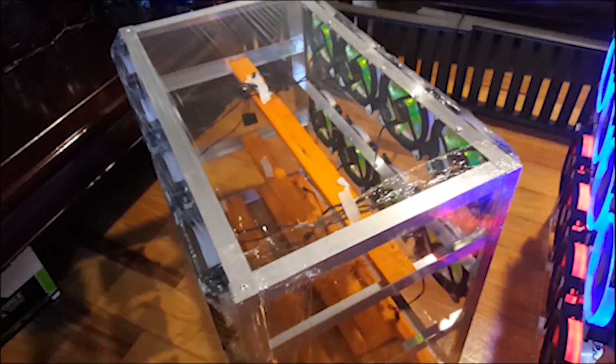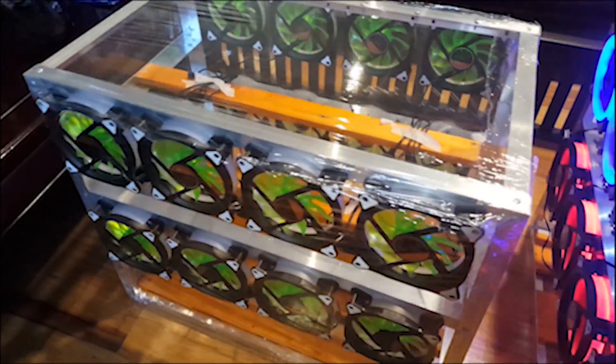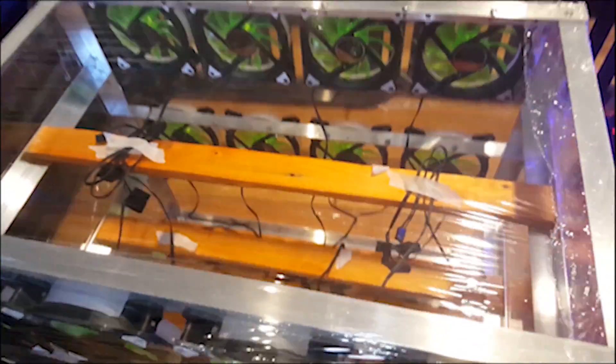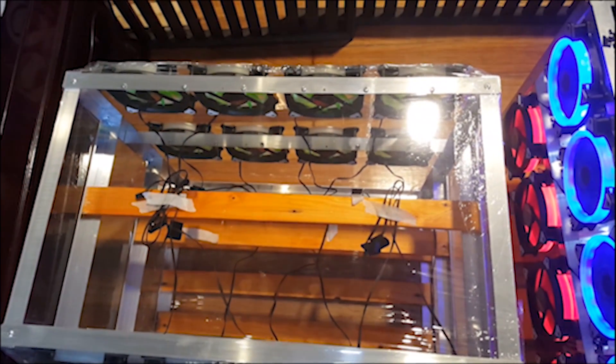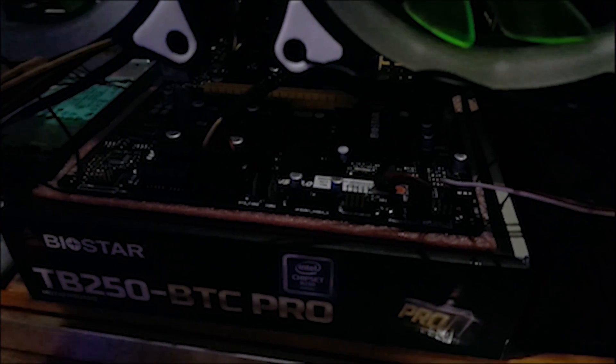I ordered the same mining rack from Mining Rack by Abbey where two sides of the rack have fans. Now to those saying this rack is pretty pointless, try setting up your rig in a cramped area on the second floor of your house here in the Philippines — then you'll realize that managing the airflow can make a huge difference. Now these are items that are not really critical but you might like to add in your build: a surge protected extension cord. There's one miner here in the Philippines where he experienced a blackout and when power went back up, his power supply immediately turned on and fried one of his video cards. These aren't really expensive so better use one just for extra protection. To avoid using a screwdriver to power up the motherboard, I used a spare 2-pin wire from an old desktop — since it's actually for LED lights, I took out the bulbs and connected the 2 wires to a switch for me to power it on easily.